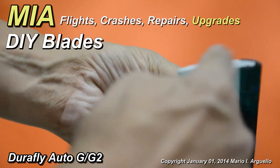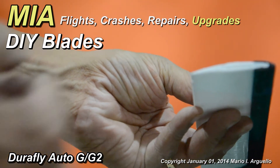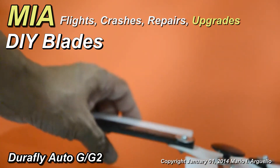These are the blades we just completed assembling. You can see the airfoil shape — it just follows the plastic leading edge shape, giving you a Clark Y airfoil. Also notice there's a slight under-camber underneath the blade, which gives it a little more lift. These blades should perform quite well.